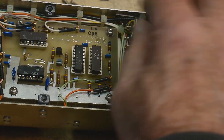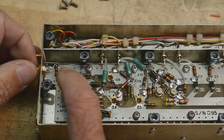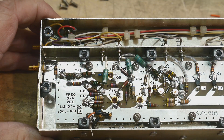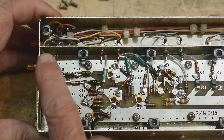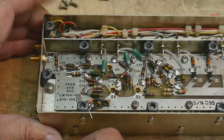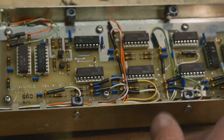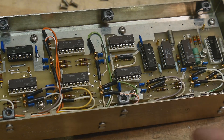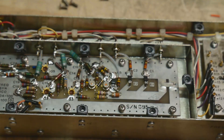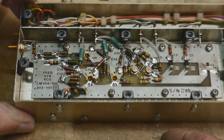This coax runs up over to here and this coax is right there, so this must be the output. There's a 33-ohm resistor to the output world with a little bit of filtering going out. The input is probably the master clock that comes over to the digital divider section. There's still a time base in the unit we haven't taken out yet - an oven-controlled oscillator that'll probably feed this with a master frequency, and then this does the synthesis, division, and outputs here.